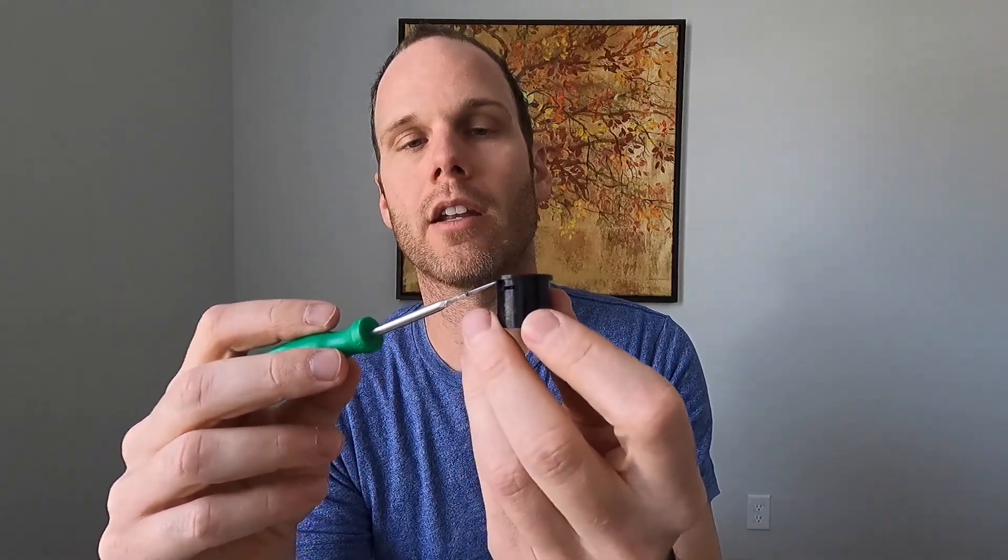So red is five feet. When it comes to Rain Bird nozzles, you have eights which are green, tens which are blue, 12-footers which are brown, and last but not least 15-footers that are black. That will help you memorize the colors so you'll know exactly how far they're supposed to spray.